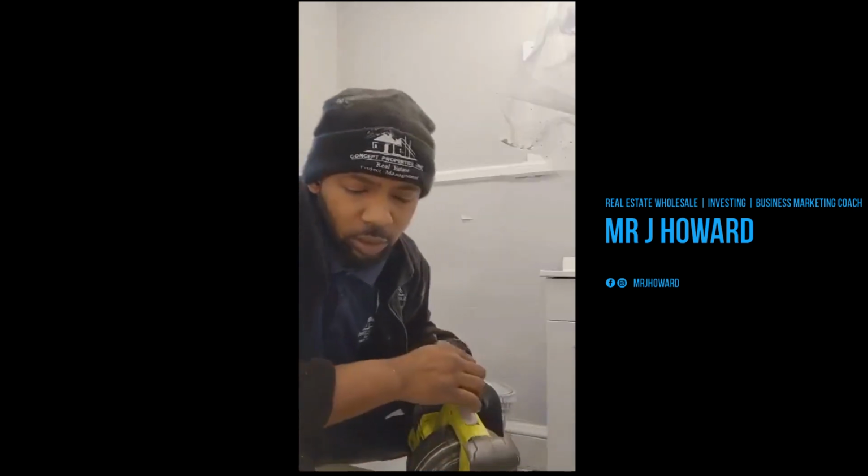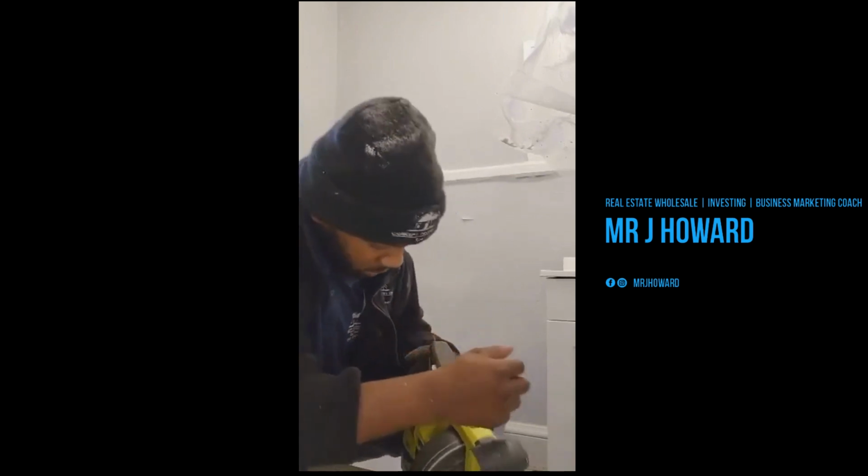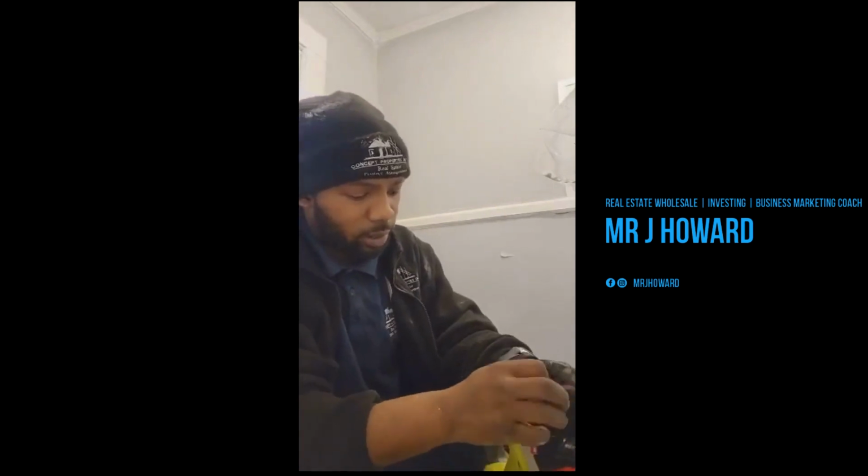All right. So also sometimes when you got a really tough clog, you gotta keep reversing it from neutral. I'm running it now, and you'll see your water kind of bouncing. Where your clog is, watch. Yeah, it's bouncing in and out. Yeah, it's raising, coming down. There's something in it, see that? But what's more important is my line is straight, so I know whatever I'm hitting, I'm definitely hitting it. So now I'll change it over to forward for a little while.